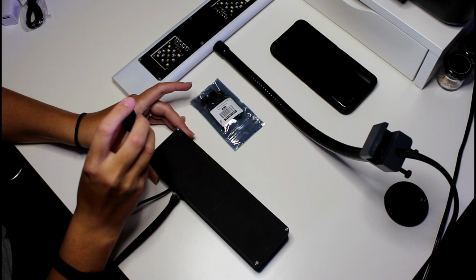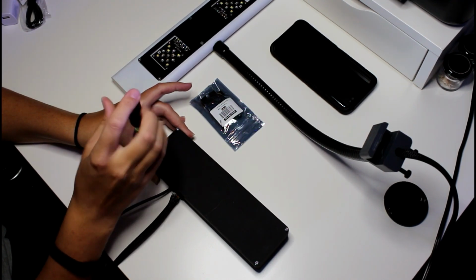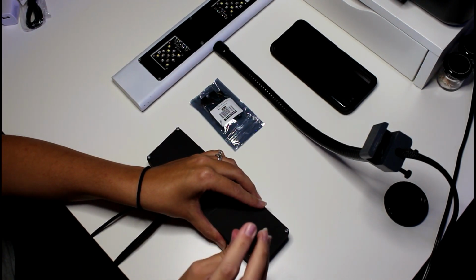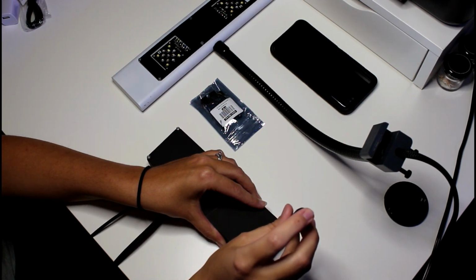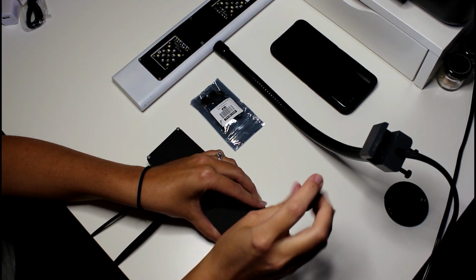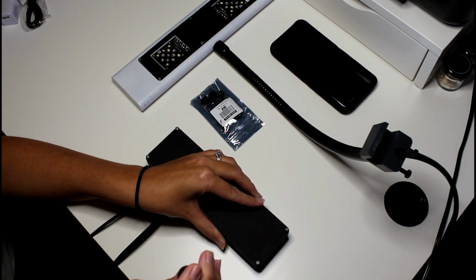When my Duo stopped working, the first thing that I did was to check that there was nothing wrong with the power adapter. The second thing I did was to check the IMP card to make sure that it was connected to the network properly. The lights on the IMP card indicated that it was connecting, so then I swapped it with the IMP card that I have in my NanoBox Tide, just to be sure. Since both cards were working in the Tide, I knew it had to be a different issue.